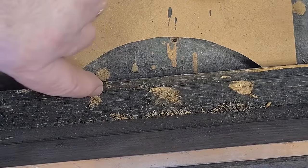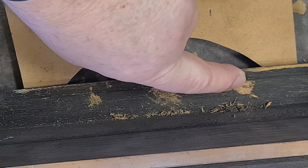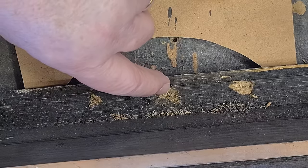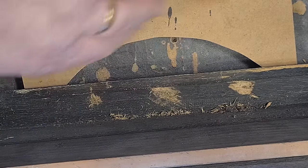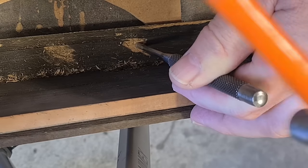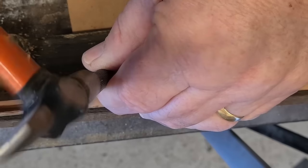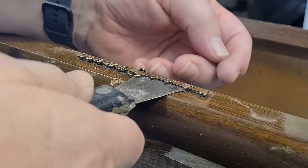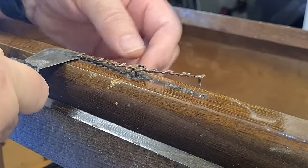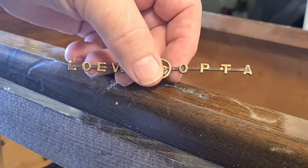It looks like the little badge has three sort of prongs on it coming through the timber. I've dug a bit of the timber away and you can see the gold tip. I can probably use a punch and push them back down - that'll give me enough room to get under the badge and pull it up. I've got my punch on the end of the pin. If I can tap it through, hopefully it'll go through and not just dome over the end. I think the badge has moved away a bit. There it is - in one piece.